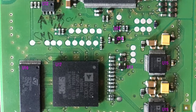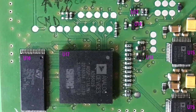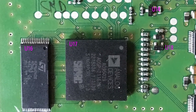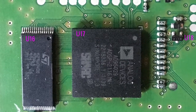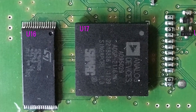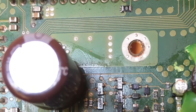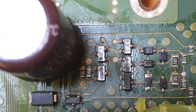In particular, for the DSP chip, check both power supply pins: the internal voltage shorted with the analog voltage pin, because they are both supplied with the same 1.8 volts, and the external IO voltage connected to 3.3 volts. Once you have identified the broken components, replace them, then power on the big board without the small board.